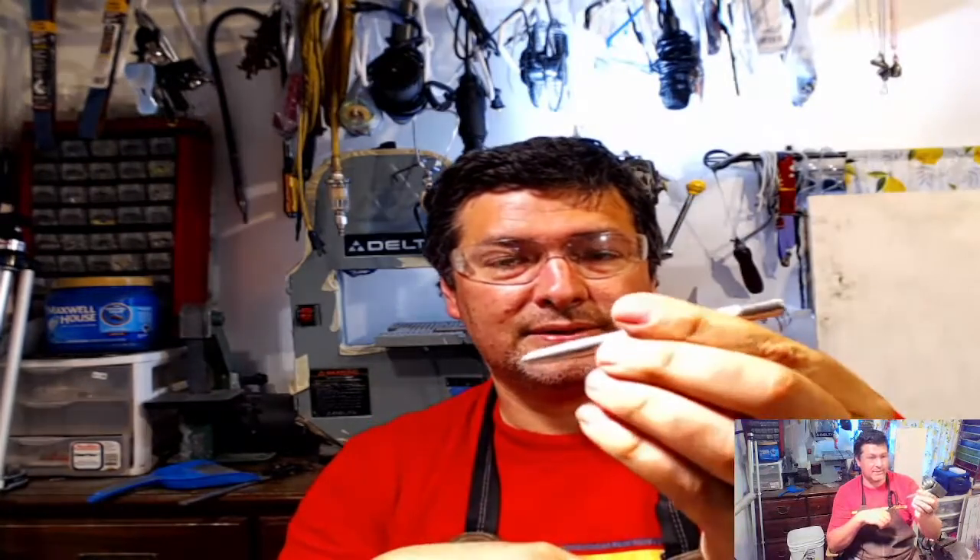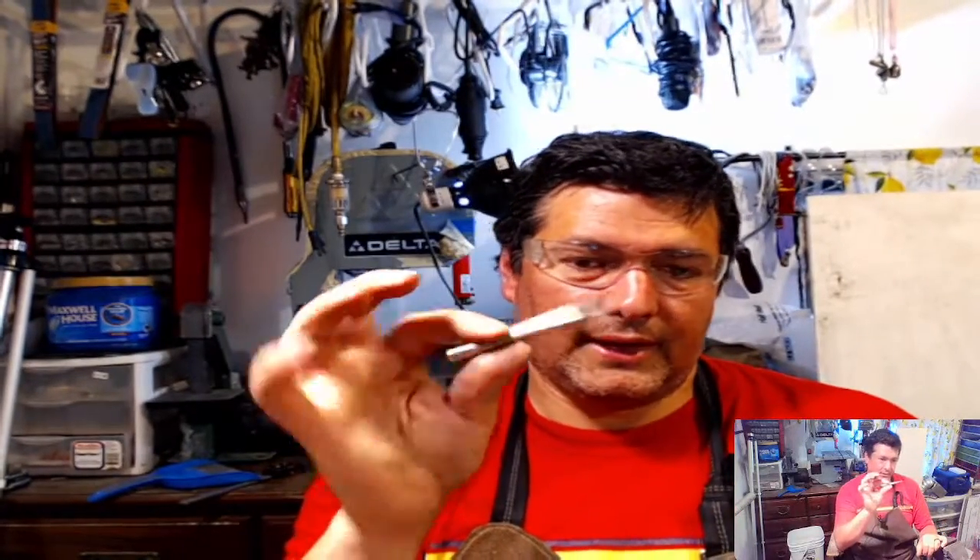The fork tines really need precision - your hole placement is very critical, otherwise your drill might just cut out one of the sides or make it so thin that it's going to be too weak. So I'm going to get down here and show you where and how I punch these. I can't find my other hammer so right now I'm just using this metal one. I've probably ground this down about 30 times over the past five years - it works great.